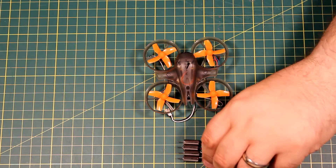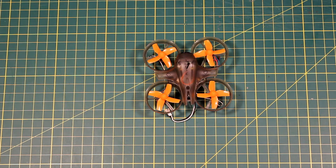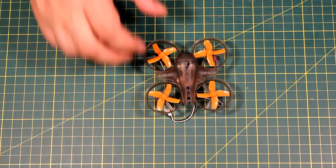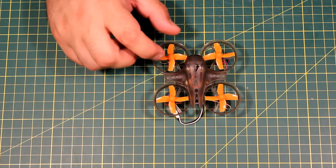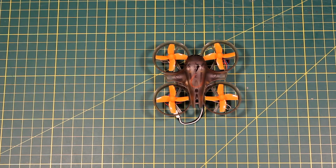I've kept the old motors in case something happens. I was quite delicate about removing them, so they should be good. I don't have any spare props, so I had to be quite delicate about removing the props — which meant that when one of the motors slipped out, I had real difficulties getting the prop off. What I could have done if I didn't care about the props is just left the prop on the motor; you can take the whole motor out without worrying about the prop. One interesting thing I noticed: these are reverse direction props — I never noticed that before.